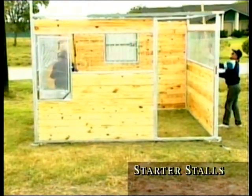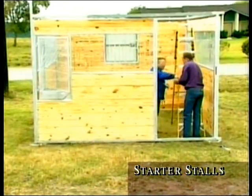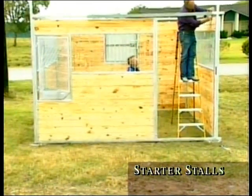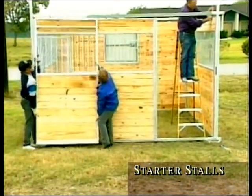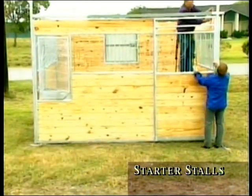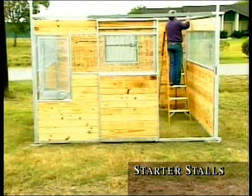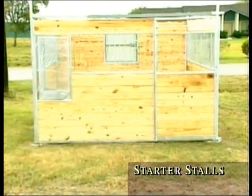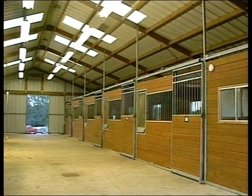If you want, you can now add roof jacks, available in any length to meet the exact pitch specifications for your barn roof. Mount your door track to the top of the door tubing. Place the door onto the track, slide it in, and latch it. You now have a completed stall. If you need additional stalls, just continue adding them, as you see here in this 14-stall barn. Notice how the roof jacks rise and support the rafters to make the roof of this barn. This is all made of hot-dipped galvanized steel construction.